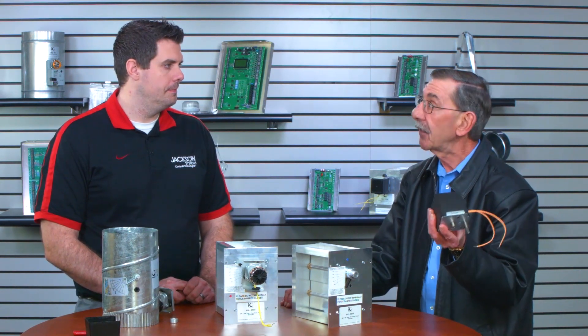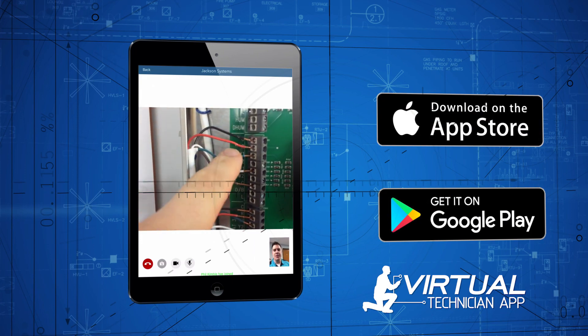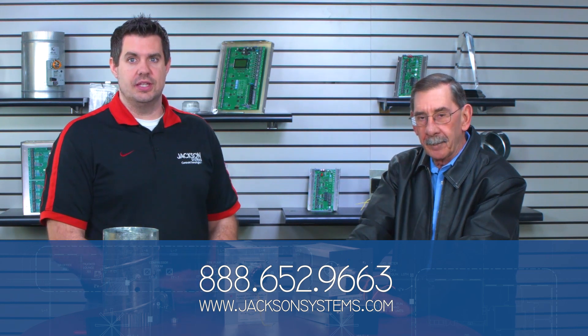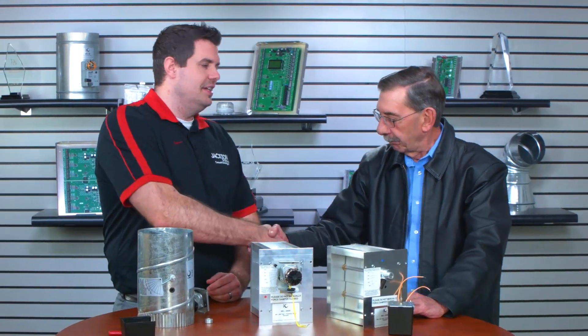When you find them, they may have a black, blue, or silver cover. We've got a great virtual tech app where a tech can show us what it looks like and we know immediately what it is and can replace it with a new one. If you need to replace a spring return actuator, contact us — we know how to do it, and we even have a little instruction sheet. We also apply the same basic methods to three-wire actuators, power-open and power-closed. Call us directly at 888-652-9663. Thanks for watching this week's episode of Field Engineering.